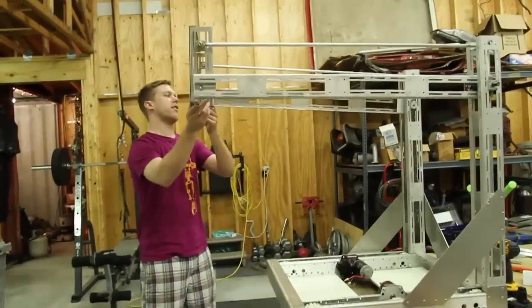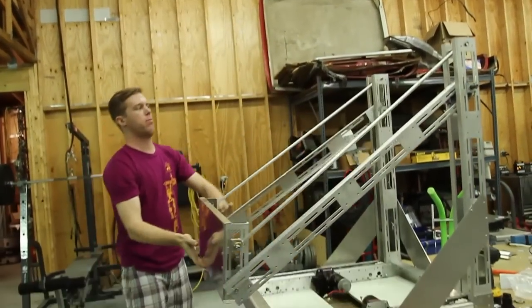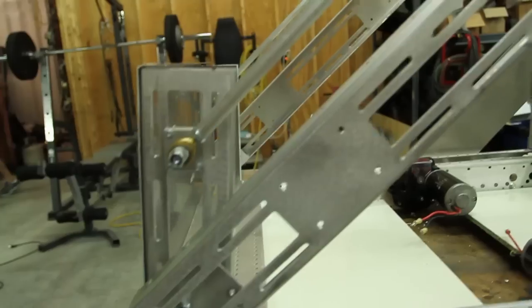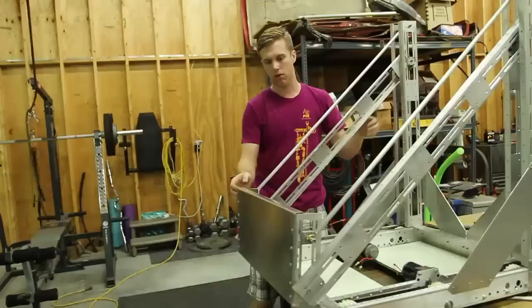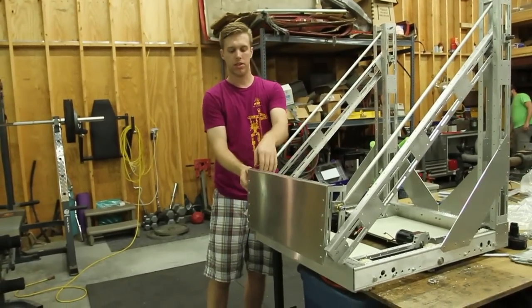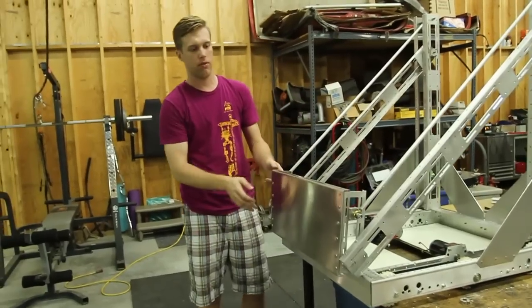We've got our four bar structure that's going to be our major arm gripper. Right now Robbie's working on framing up the box. We've got Modulox tubes running here so we're going to have a little bit of adjustability in the front — if we want to be able to tilt the box back, we can just adjust these blocks down and we get a unique range of motion for the front panel.